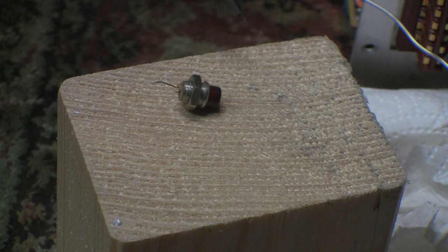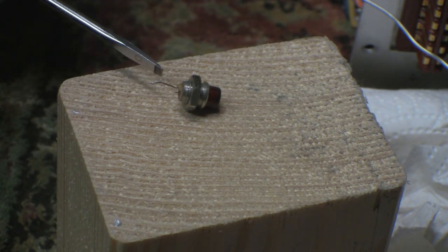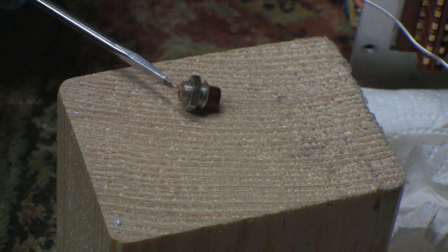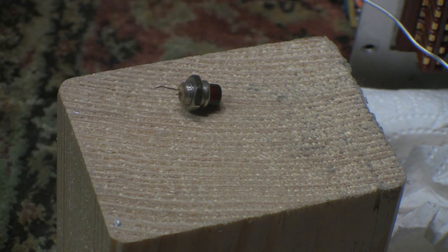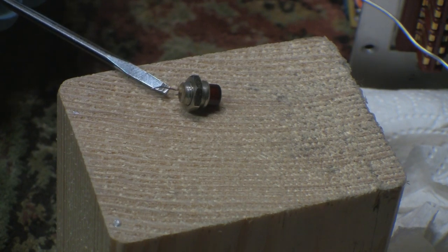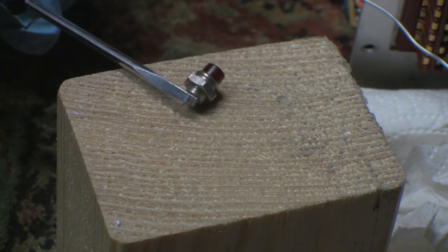This is the little indicator bulb that the pink wire was going to. There were burn signs at the end of the wires where one had come off, right at the edge of the bulb — which is a sealed, glued-up affair. I cut the glue back enough to expose the other lead so I could tin it. More bad luck: the one on the other side also has its wire disconnected. It'll be exactly the same — one lead snapped off. So I need to find out what these are and see if I can find a replacement.